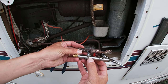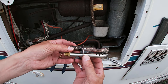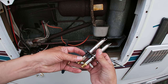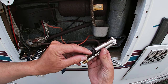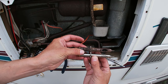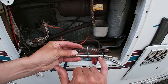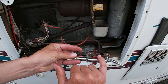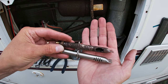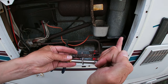So you can see the problem here — quite a spectacle, to be honest. The new one is nice and clean; you can see that they match up. I've got no bugs in my oxygenation tube, but there is a bunch of corrosion on it. Here's where the bad news starts: the little ribs on my diffuser have corroded completely off. They're just garbage — gone. So my flame was coming out basically missing the heat tube completely.